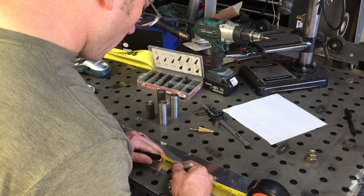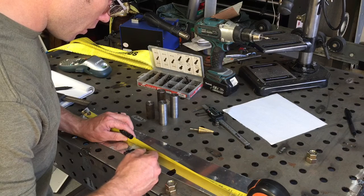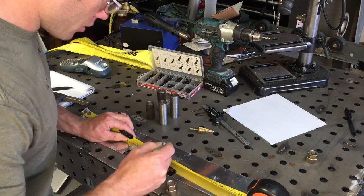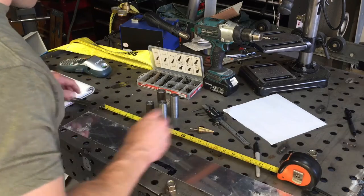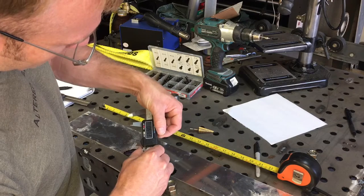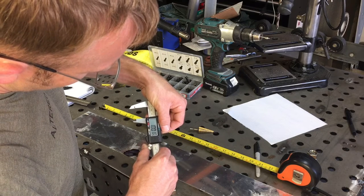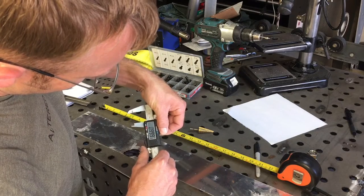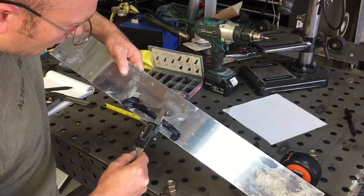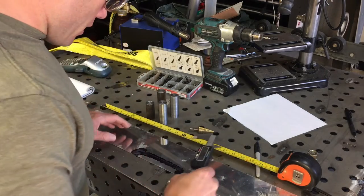You don't have to wait for it to dry. We're going to be scribing another line at 15 inches. We also know that we want our notch one inch tall, so we'll make an area for that scribe line. We'll set this digital caliper for one inch and scribe our line. Simply take your caliper and drag that across — you now have a nice straight line.